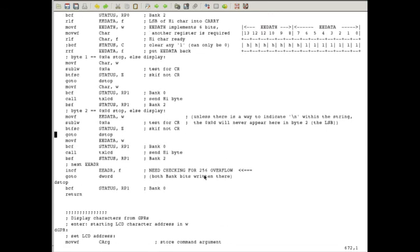The rest of the routine puts out our data: we first check for carriage return — if it's not a carriage return, we send the data to 'transmit_lcd'. Then we load the second character of the pair, check it for carriage return, and if not we send it out. If we ever find the carriage return we jump to 'D_stop', fix our register bank, and return. That's the driver basically. Let's go see how that works.